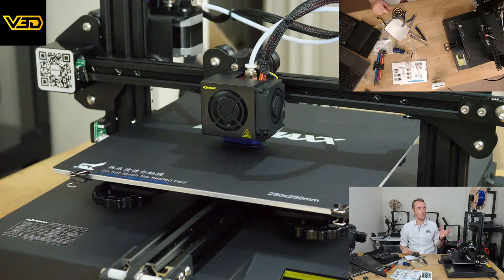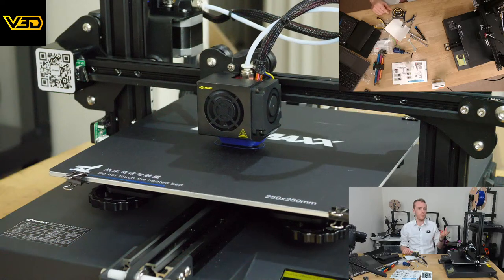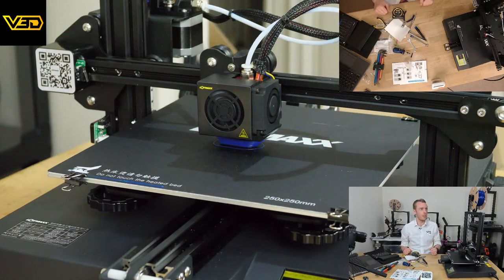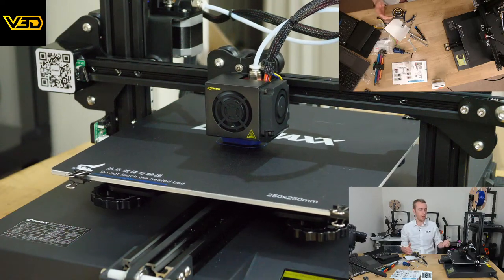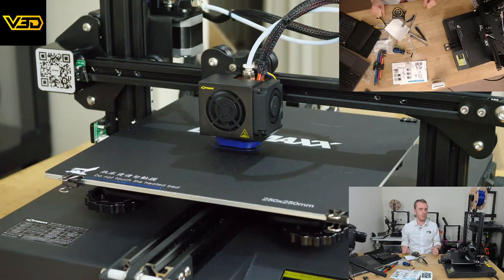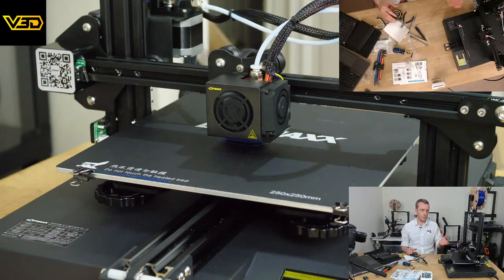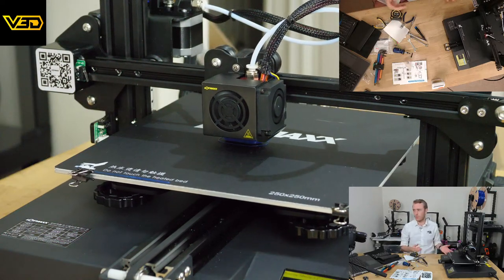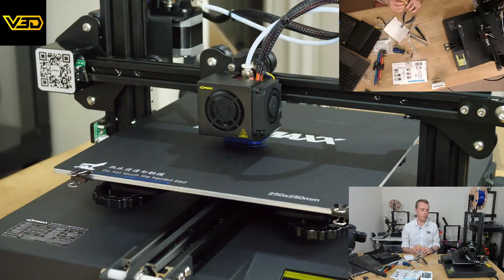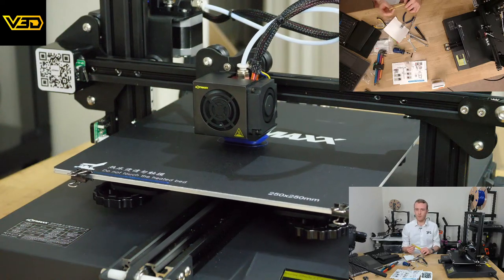With a TFT, it's such a basic device, and the manufacturer, obviously it's designed for 3D printers, they've designed it so it doesn't turn off. As long as you have a strong connection, which means no interference, no dodgy cables, no overheating, then there's not going to be an issue. You do have to be a bit careful with the communication cable. If it's too long, it can look like it works and then doesn't after a little while. But in general, if it's implemented fine, there shouldn't really be a problem. It's just a serial interface, the same as the serial interface on a board, just over a wire instead of across a PCB. So in theory, no. In practice, I think there are some teething problems with those products at the moment for that reason, but nothing major that I've noticed so far.